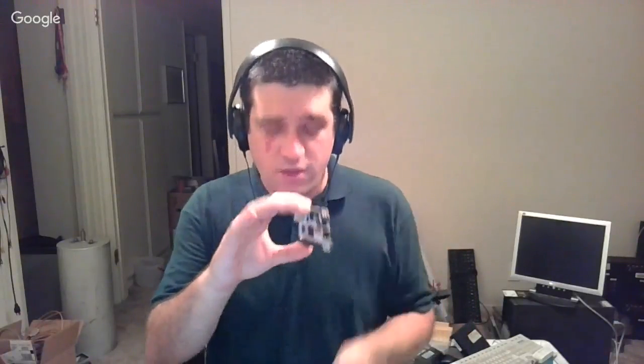But what the plan was, I was going to have a piece of DIN rail available, and then the BeagleBone was going to have the cape on top of it that had the four serial ports as RJ45, so it was going to be a straight Ethernet cable point to point. And then I actually managed to find on Thingiverse the super cute DIN rail mount for the BeagleBone. Let's see, here's my M3 hardware that screws onto the four mounting holes on the bone and then snaps onto it. Right, so that was supposed to be the idea.